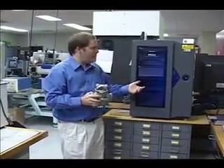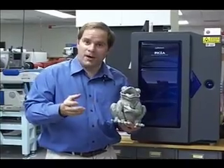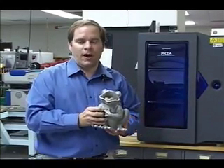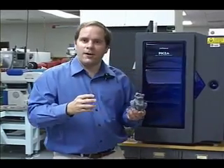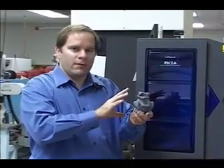Another machine we have here at Riverside Community College is a three-dimensional laser scanner. It uses a laser similar to what you'd use in the construction industry to measure each aspect of a very complex part. We then take that complex measurement and put it onto a computer in a three-dimensional model using SolidWorks or another computer program. We then take that computer program and put it onto our rapid prototyping machine, which can make the part any size you want — scale it down or make it larger — and it will layer by layer create the part in three dimensions.